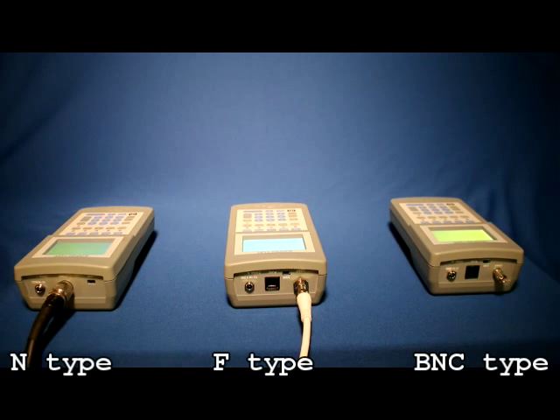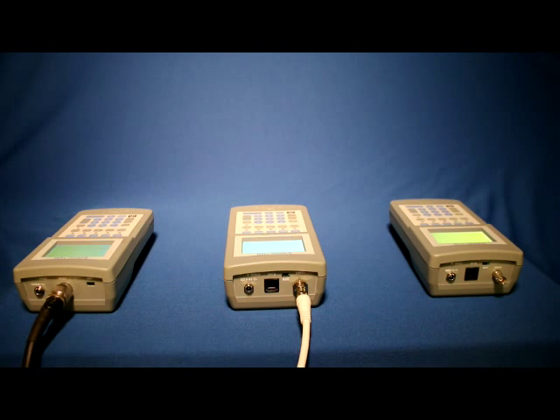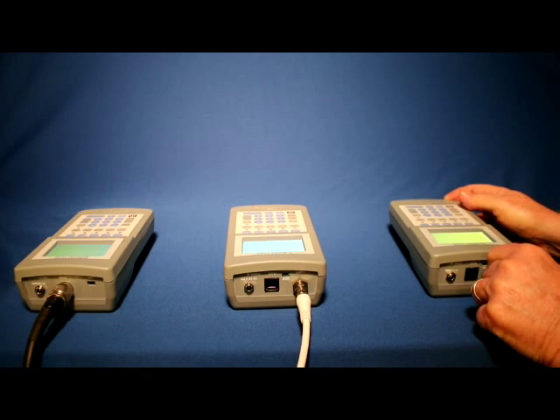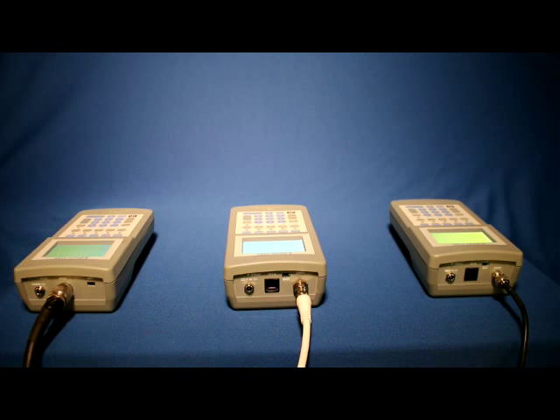The first step is connecting the cable under test. If your TDR's connector is an exact match, female to male, for the connector on the cable, you can connect directly to the E2020 TDR. Since our TDRs have no dead zone on any range setting, you'll not be blinded to the near end of the cable. If the fault is an open, short, or other issue right here in the connector, that's where the trace will show it, and we have an example of that later.